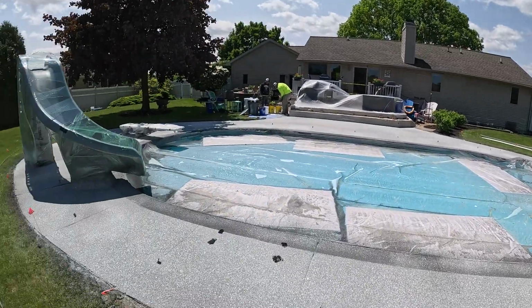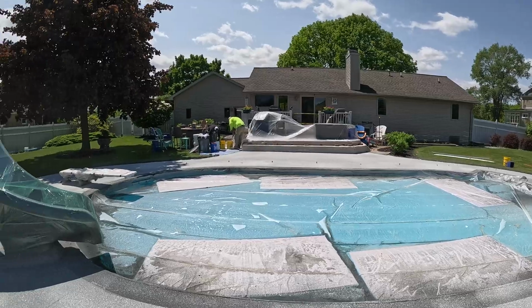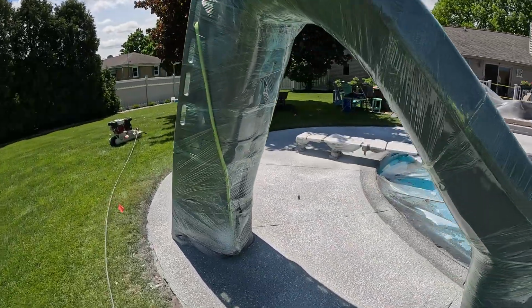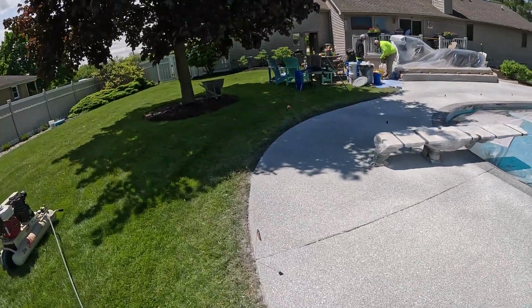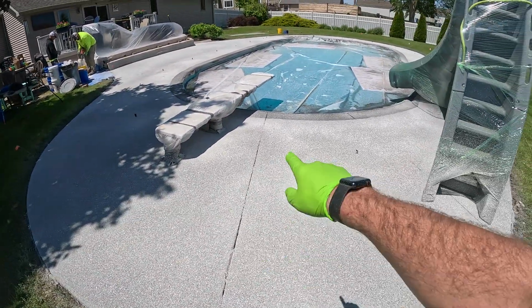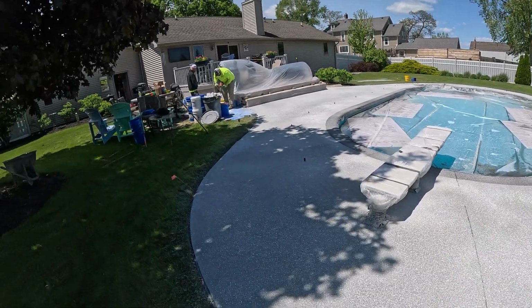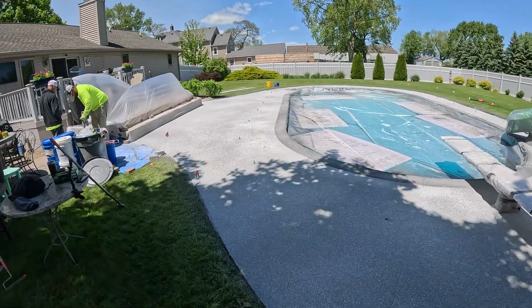and then pull our paper and our plastic down over on the porch, clean everything up, and it'll be a Saturday. We'll have to come back next week, and we're gonna cut these saw cuts open, and then I got a bevel blade we're gonna cut them with on like a 45, and then caulk them in with a nice light gray. It'll look sharp. Stay tuned.